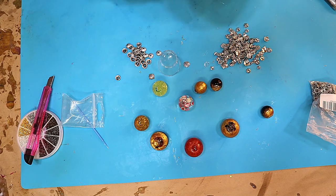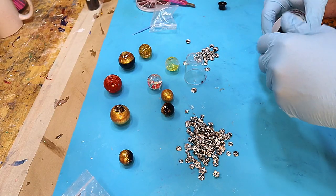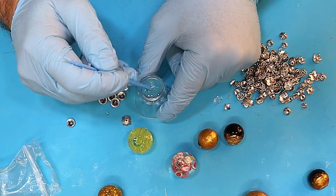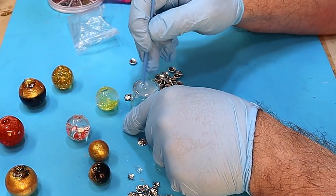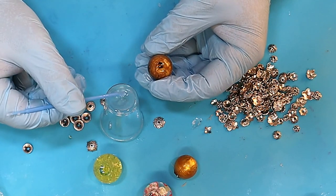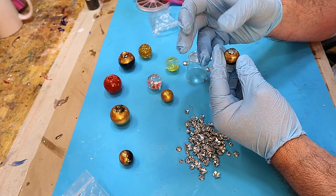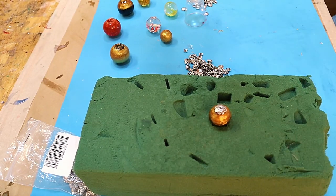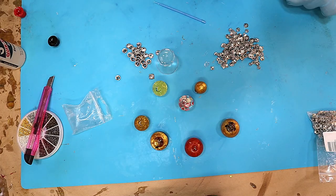I'm going to use five-minute epoxy for this — an equal amount of part A and part B. I use this for a lot of different things; always use gloves when using five-minute epoxy as it does stink, and you have got five minutes to get it done. Give it a good mix — it will go quite cloudy and bubbly but it dries completely clear and goes very hard; it sticks to resin brilliantly. Put a nice amount on the sphere, take the top cap and line it up as centrally as you can, then pop it in a bit of Oasis, sand, or plasticine to hold it while it dries without moving.